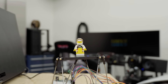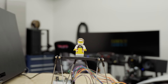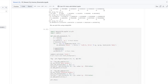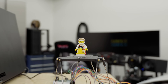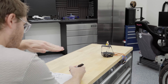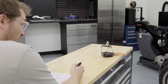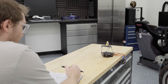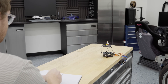With that, I could drive the platform. I melded my script with Yoksi's StewartPie repo and finally got to testing the platform with the car's gyro. I'll put a link to Yoksi's work in the description — he did a really awesome job; I'd be completely deadlocked without it. I implemented travel limits for pitch, roll, yaw, surge, sway, and heave, then started working on scaling and filtering. This will be an ongoing process, though my test subject isn't a very good communicator, so I don't really know which movements feel right relative to the car's movements.